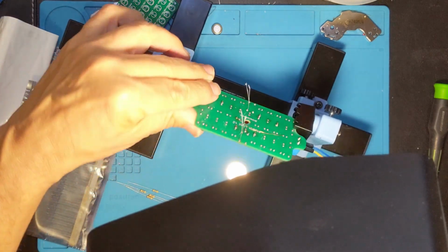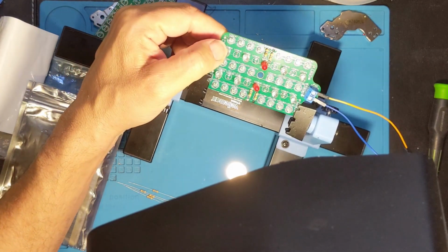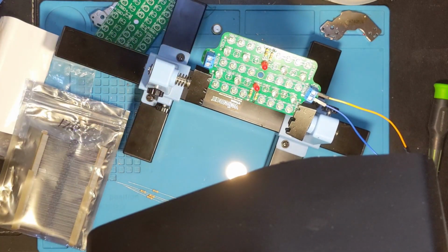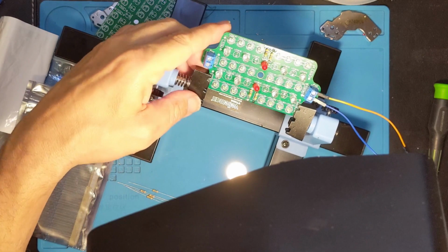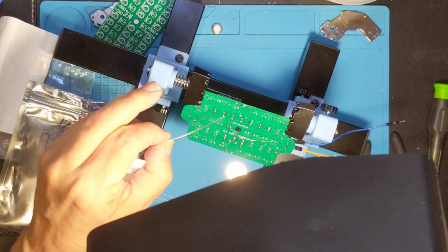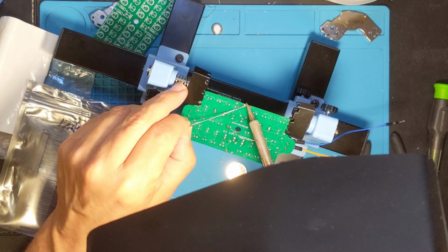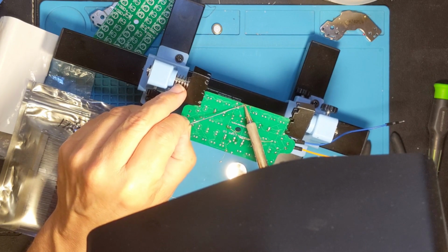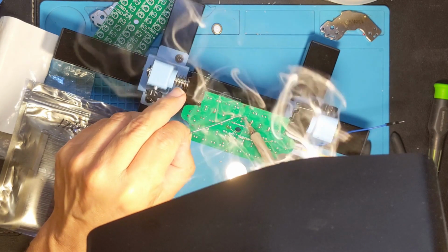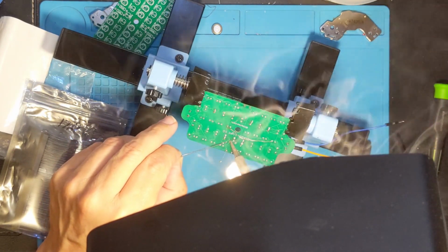And if I'm right, they're probably sitting a little bit wonky. Yeah, they're not sitting down perfectly, but they should be electrically connected. Now I'm just going to reflow the solder on those couple, and that should take care of the resistors for the infrared part of the stealth light. Some fresher solder on there, make it a little happier.